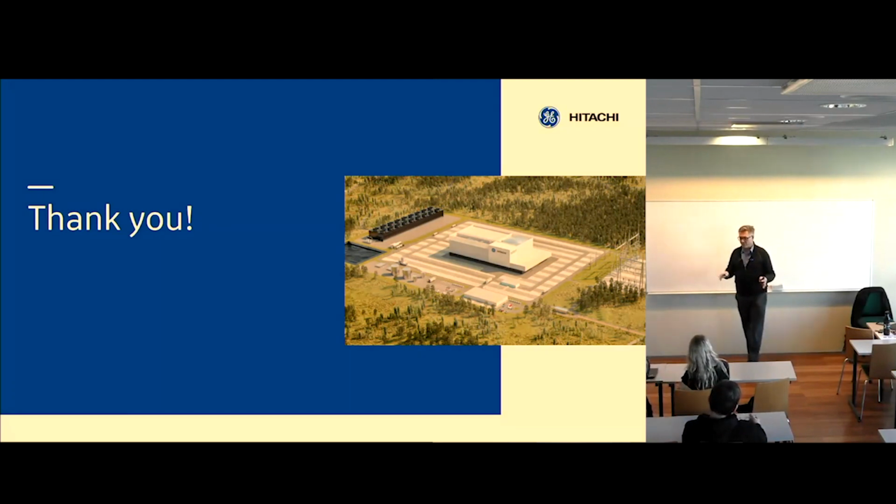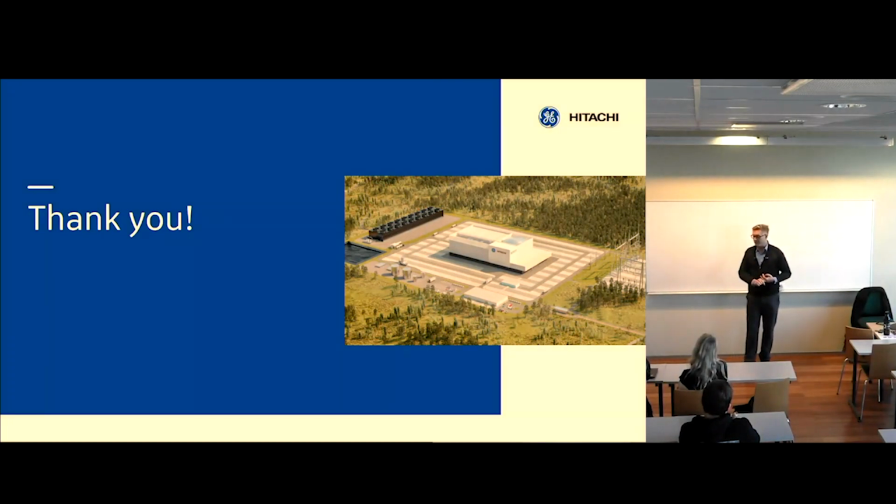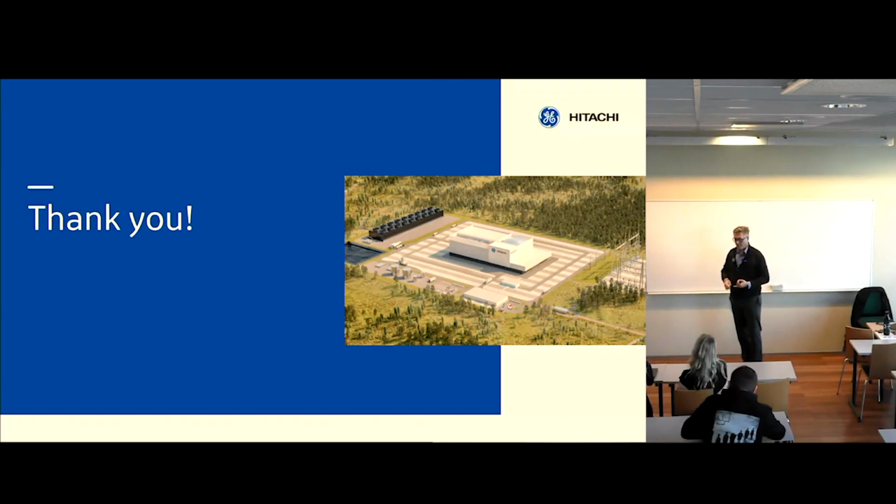Seismic event, everything was fine. Flooding, we lost all electricity. And that plant relied on electricity for a lot of its functions. Like for decay heat removal, they needed pumps to do decay heat removal. In this plant, we don't need electricity to do decay heat removal. I think that's the key difference here. We also don't need the water in the ocean to remove decay heat in this plant because it's in the reactor building.